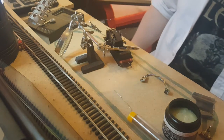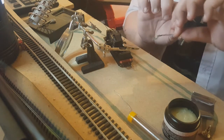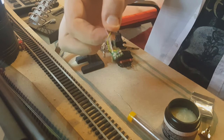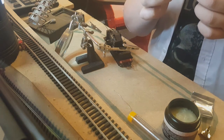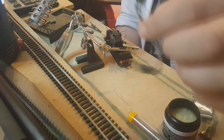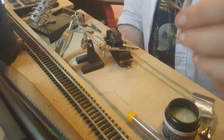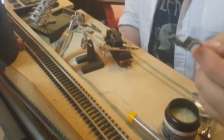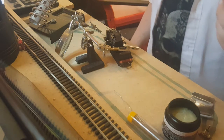The first thing we've got to do is take the plug off the end of it, because all these decoders come for DCC-ready locomotives — not DCC-fitted or non-DCC. If it were already fitted it would be so much simpler: you'd just pop it on the socket and it's good to go, and add it to your RailMaster or whatever you're using.